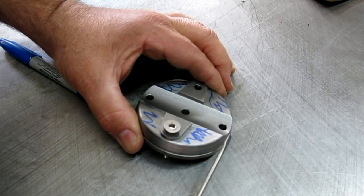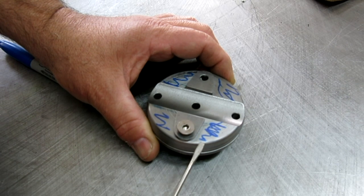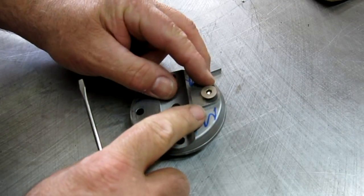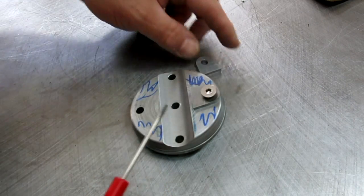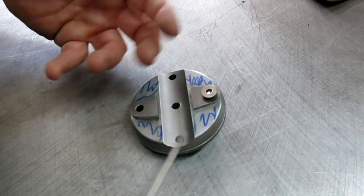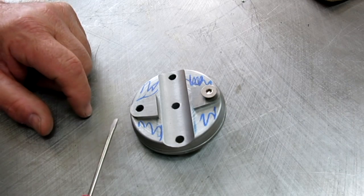That doesn't address the radius around here either. To do that, we'd have to plug this into a rotary table and rotate around that, or do that work by hand. And probably one of the bigger reasons: remember we put this nice radius on here — we got to do that in the machine so it's nice and uniform all the way around. That would be a sharp corner otherwise, and you'd either have to go around that with a corner rounding tool or do it by hand. So to me this is a six-of-one, half-a-dozen-of-another kind of argument. This is probably more like how the actual casting pattern for the base was made — they probably glued some little blocks of wood down, shaped them, and built the pattern up out of wood. So we're kind of doing that in metal in this case.